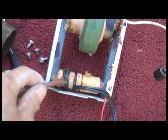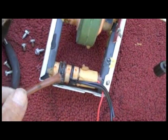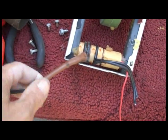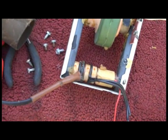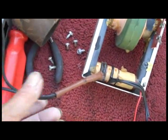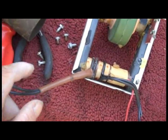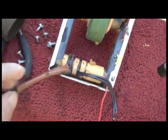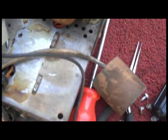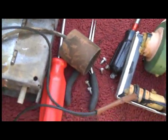That transfer was a success. A heat gun was used to heat the assembly so the jacket could be pulled off. The jacket and all the wiring were completely soaked in wax that had leaked out of the burnt transformer, fusing the wires together. This jacket is important because it clamps into a hold-down point and provides critical insulation to prevent arcing.